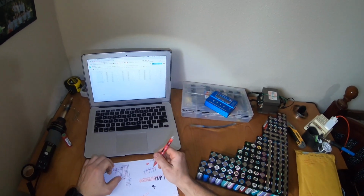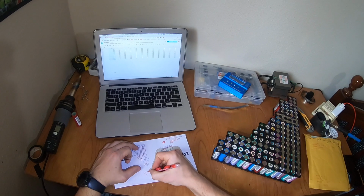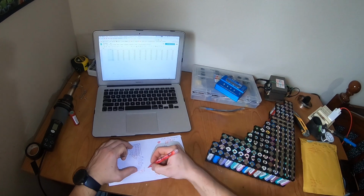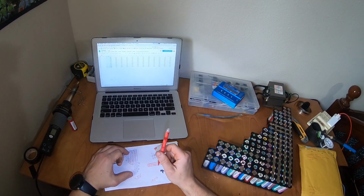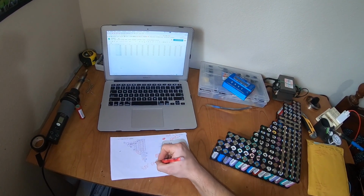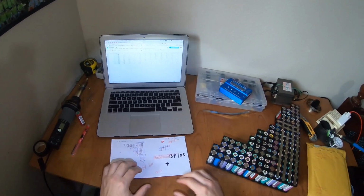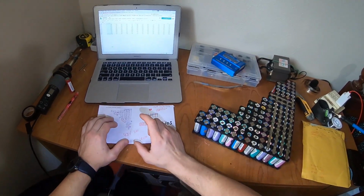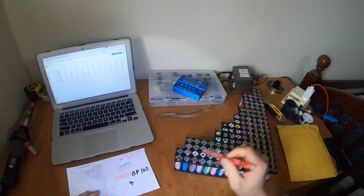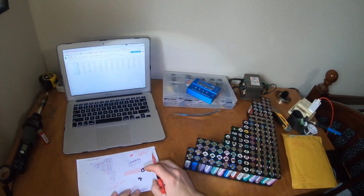In the future it should be 48 volts nominal, and the maximum, if I remember right, is 58. If I'm not right, in the description I will write the right number. So for these cells I decided on 13S, excuse me, 13P.